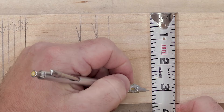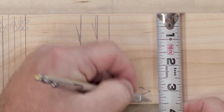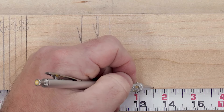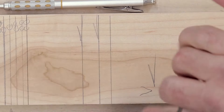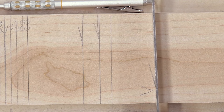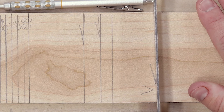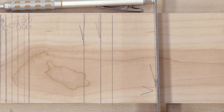I know it's roughly three inches, so I just eyeball that distance — I don't measure it out precisely. When I bring the board over, I make a mark at, say, 13 and a half inches. Then I bring the blade down to the material and scoot it one way or another until I'm right at the edge of that mark, and I cut. That's going to be my waste, and now I know this is right up to where my intended mark was.